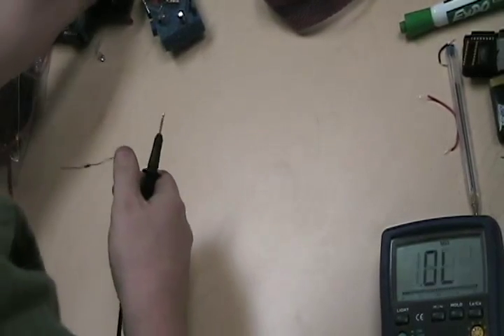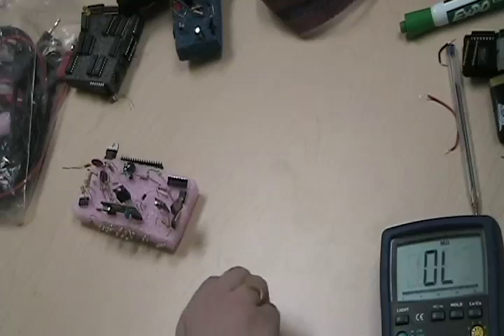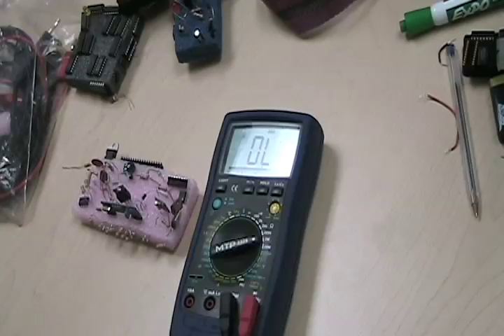That's quite a bit of resistance. If I were to measure a 1 megaohm resistor while touching the leads, my body's resistance is in parallel with it. Touching both leads while holding the probes gives a different reading than just placing the probes alone. Without touching the leads with my hands — just using the probes — you get a true 1 megaohm reading. So always try never to touch the leads, because you're putting your body in parallel with the component.